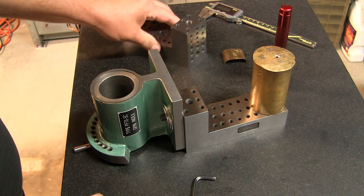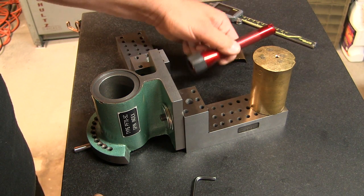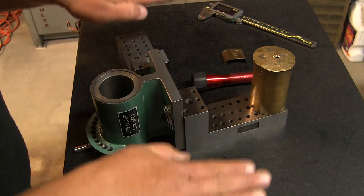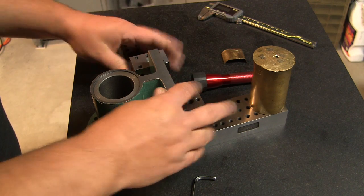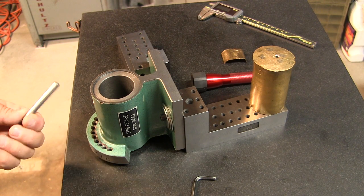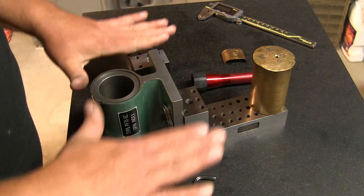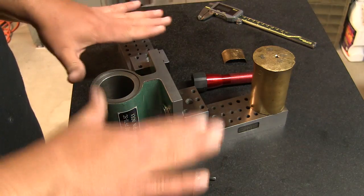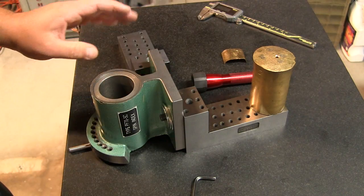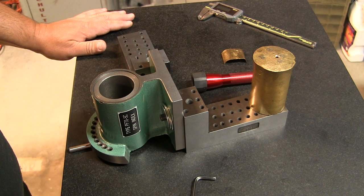I have this pressed up against here and I used a flashlight to check the light, making sure it was as perfect as I can possibly get it. What I did was I used these precision pins that are hardened and ground — one here and one over here. That allowed it to support and allow for the pivoting. So I got it bolted down and squared up on both planes.